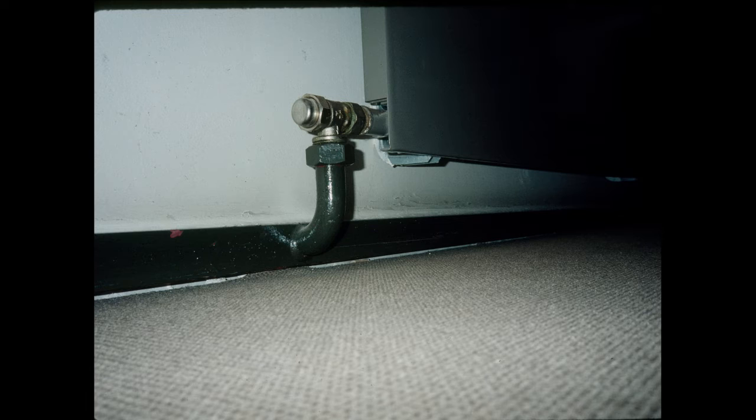So, we might suggest you go to the fire department, get one of those big trucks. They've got pumps that could do that. Or better yet, we tell them about the trick with the four-way valve and the timer and reversing the flow, and often that will get the guy off the hook, because if the radiant is in a slab and you can get it hot, you pretty much get it to work. So there you go, lessons learned from traveling overseas.